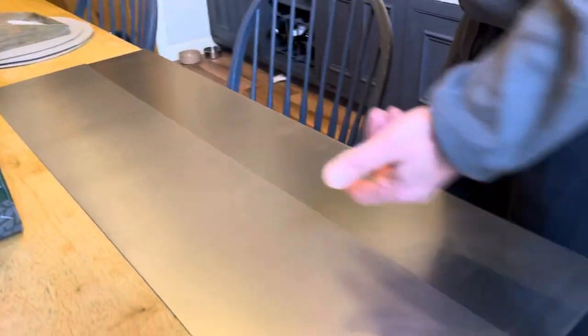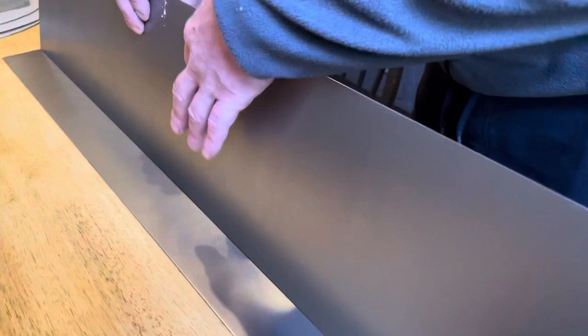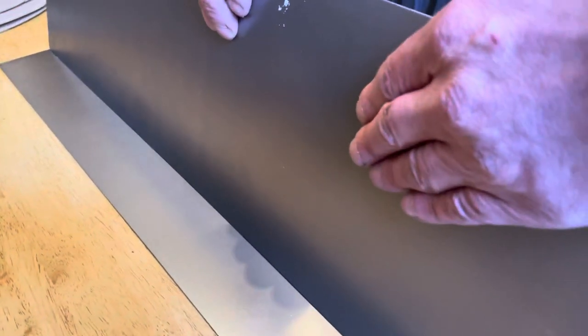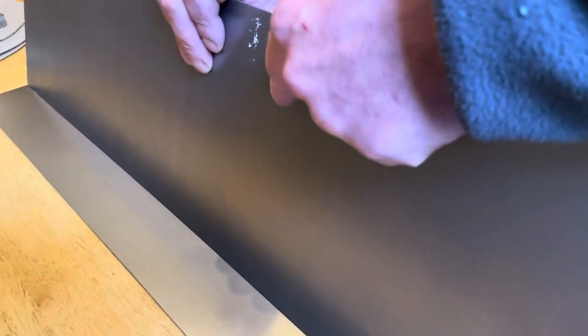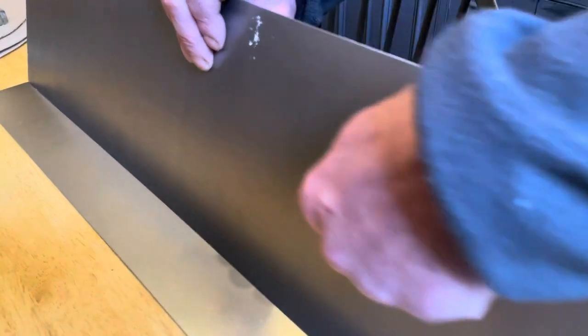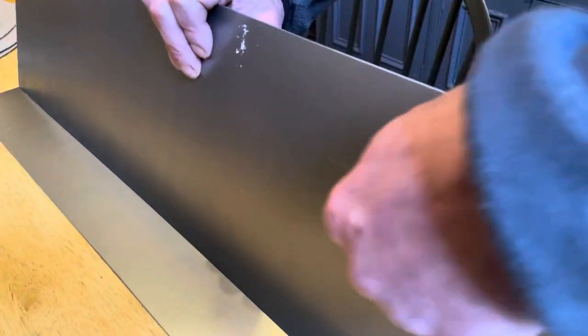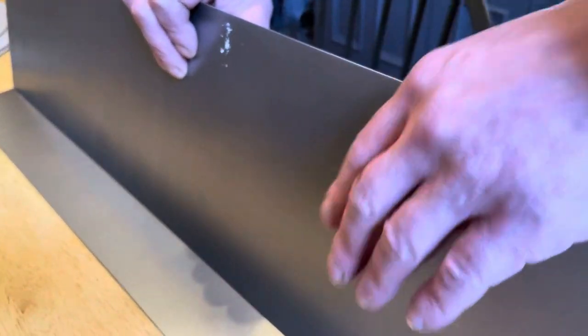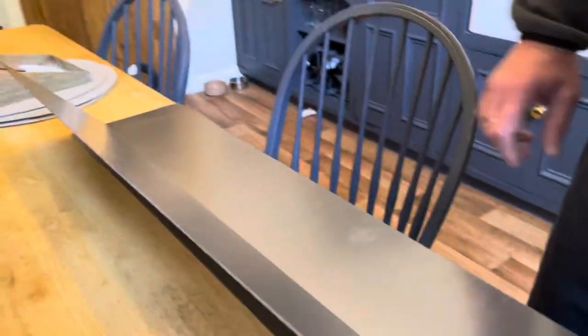Then paint it and protect it, and Lanoguard it on top of the paint to keep the water off and keep it protected. We also take the treatment off the back of the patch, paint the back of the patch and Lanoguard it. You might think it'll melt when you weld, but it doesn't — it does at the edges where you're welding, but in the middle it'll protect it from the inside of the chassis.